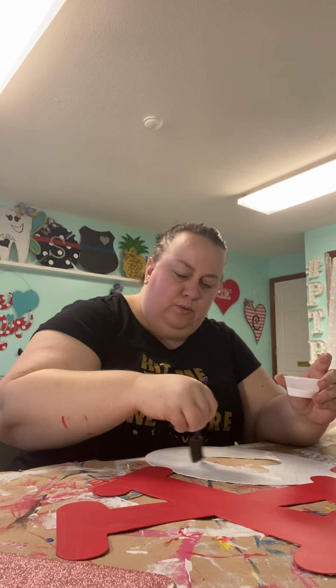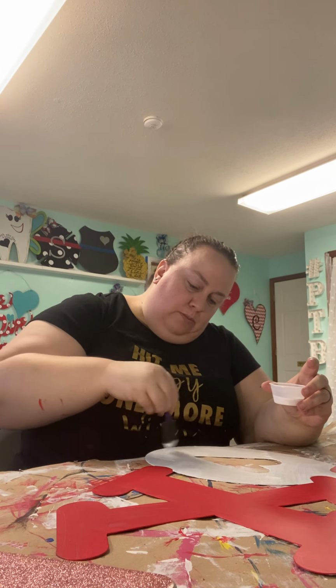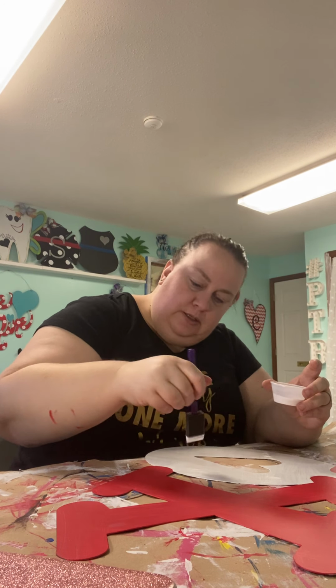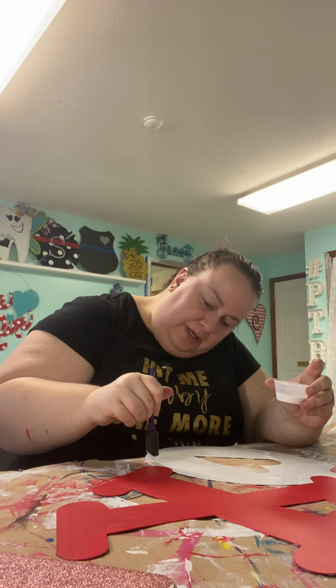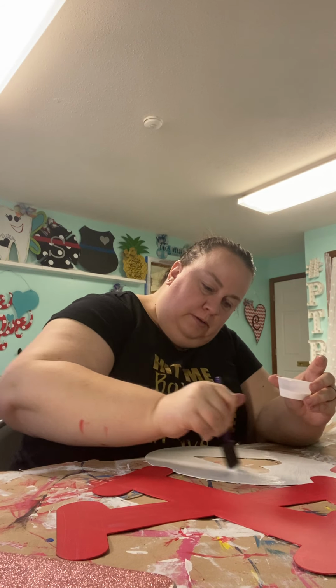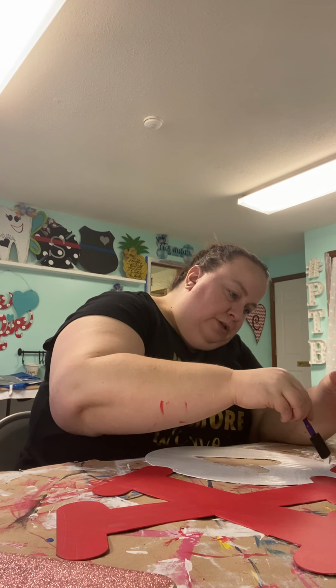If you're going to add a third coat, and we will be adding a third coat in another color in my stripes, we want to still be mindful of making sure that the paint really dries, okay? When you don't fully dry paint and then you paint on top of it, it can get a little gummy and it's not a good look, okay? So again, keeping the coats thin and in the opposite direction if you can.